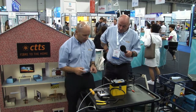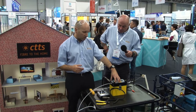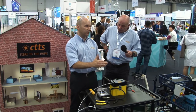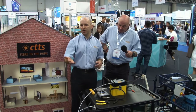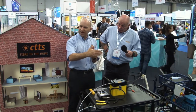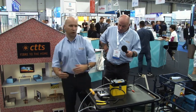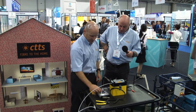The first thing I do is I run fiber into the tube. When I pressurize the box, the air will run into the chamber, and it will have the effect of pushing against the fiber. So I want to run fiber into the tube system before I introduce air pressure. Otherwise, I'm trying to force the fiber against the edge of the connection. I want the air to force the fiber down through the tube. So I'll start off just by running the wheels slowly.